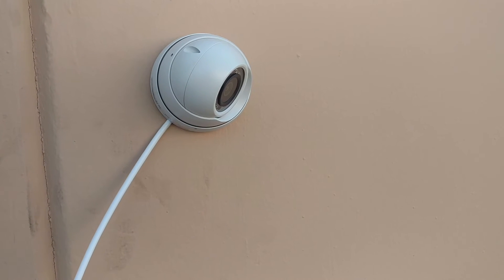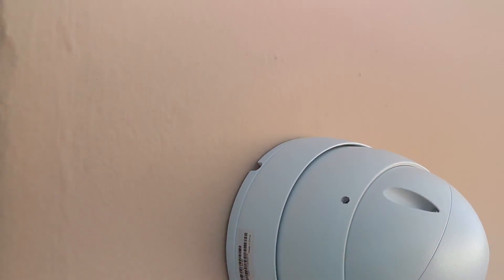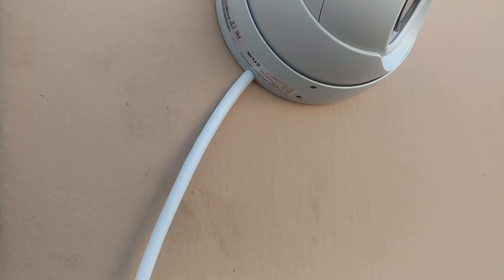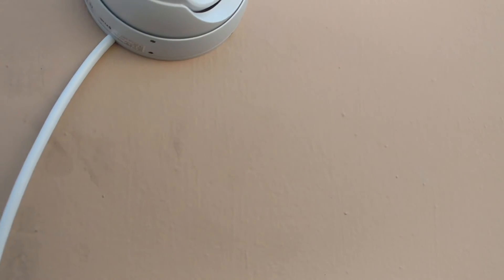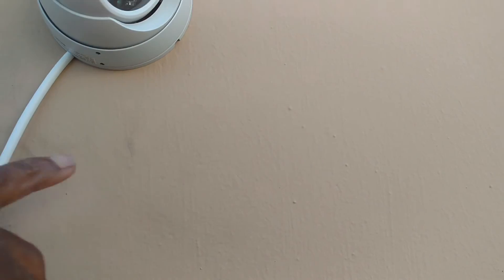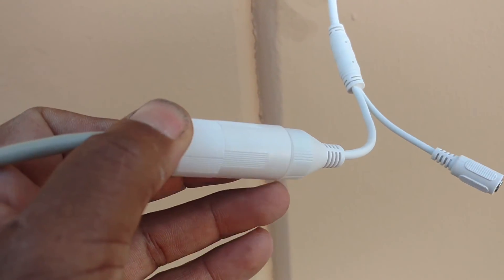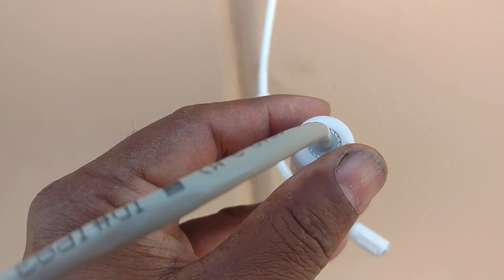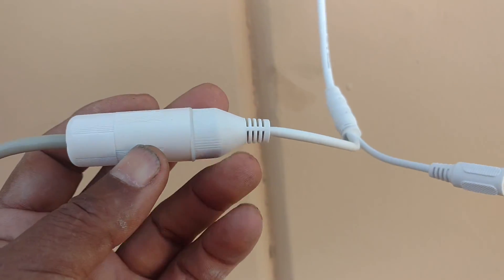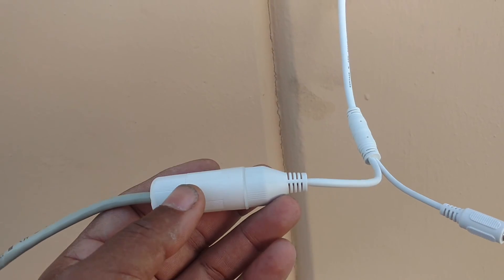So nothing should move them without effort. I put these up so that the cable comes out in an X pattern. I probably may have done a little better making it come out in a T pattern, because that way if water goes in, it could drain out the bottom — but this is probably fine. This is how the connector looks: the seal is around there the whole way. Try not to pinch it so that it comes out, but it's still being held. Screw this in tight — that's how the back of it looks. This should be weatherproof and not let any moisture in and cause that connection to degrade.